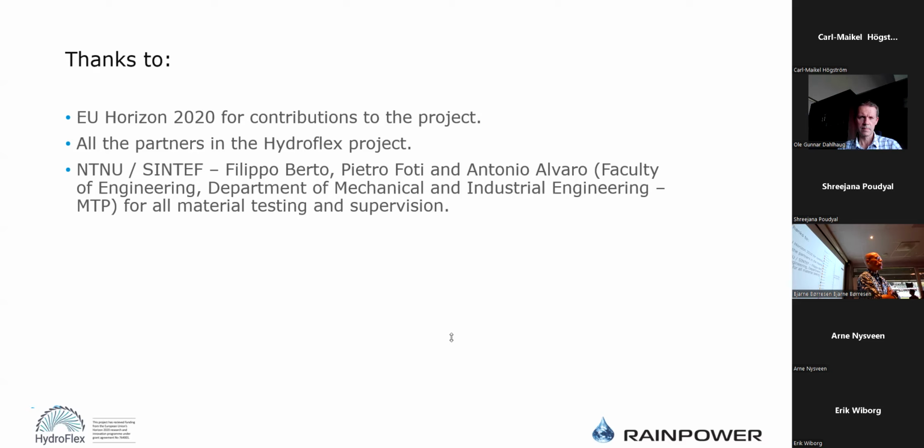But do you calculate the stresses based on the force you introduced? That's right. We measure the area accurately, and we measure the force. So have you taken into account the effect of added mass, for instance? I suppose that you have some. I didn't see directly in the picture how it was done there, but could you have an effect from the water, which creates higher forces, which is not affecting the test pieces itself, but you measure an additional force coming from it? Do you understand?